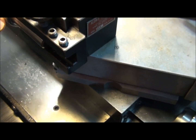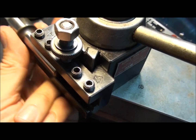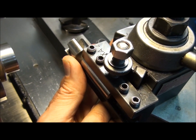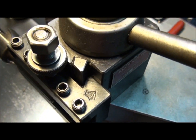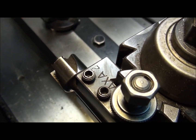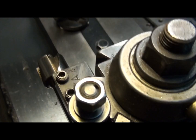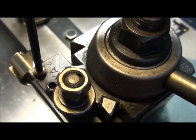The quick change posts are much easier to use for this type of work. You just put your cutter in and rotate it until it's horizontal. Also, the thing about a form cutter is there's always a lot of the cutter in contact with the work, so the possibility of chatter is pretty high. Keep everything up tight, reduce overhang as much as you can, and keep everything close to the tool post.